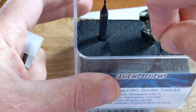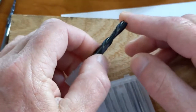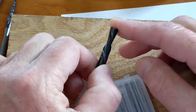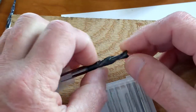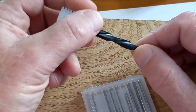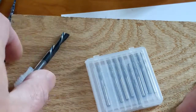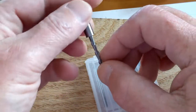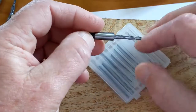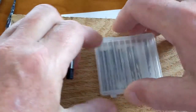The difference between high-speed steel and carbide — I definitely recommend carbide once you get warmed up on your router. Carbide tools last much, much longer but cost a lot more. This quarter-inch carbide down bit is about $29, so you treat it carefully. For my eighth-inch end mills, I bought a set — probably around $20 for a whole bunch of them. These are up bits, but you can do a lot of fine work with them.